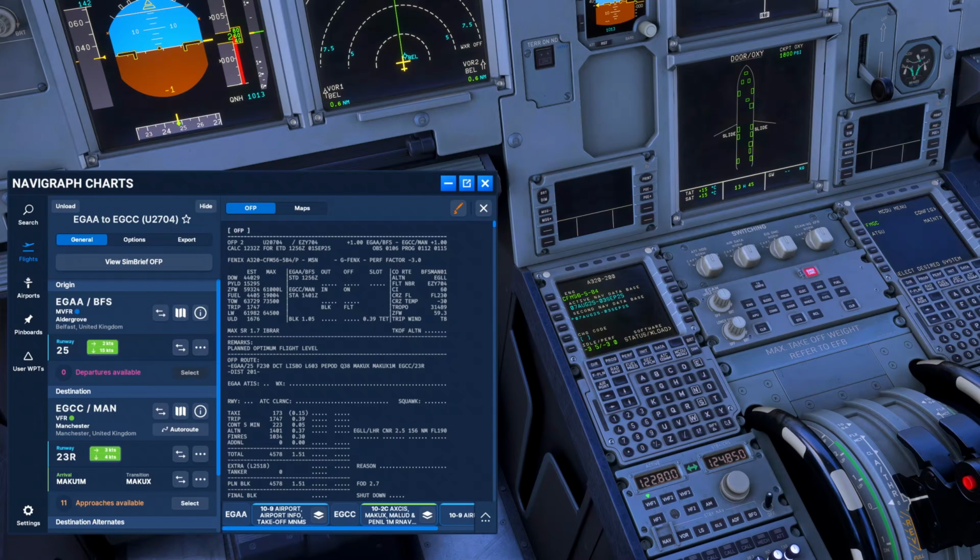It's usually a minus because what that does is essentially a minus figure tells the MCDU there's more drag and adds drag to the calculations. So over time, an aircraft becomes less efficient, and therefore we start to get minus numbers going into the performance factor. So you can see I put -3, that's from the performance there. And I put my operator's standard fleet idle figures in there.